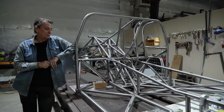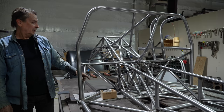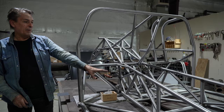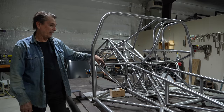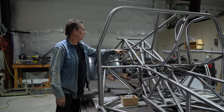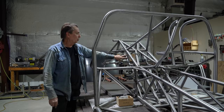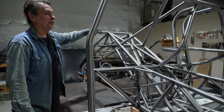So how'd you get to this point, Danny? A lot of work. We just — like I'm sure you've probably seen in some of the other videos — we start with this cross member here, then we put the main frame rails in, then we put the transmission cross member and four-link brackets, X brace here in the center. We just get the bottom section kind of done. Then we go and start putting in the double frame rails, get those in both sides with all the gussets and tubes. Then we go to the back and start by mocking up this position, put this tube in, get that in position, put the X in the center, and these go in.